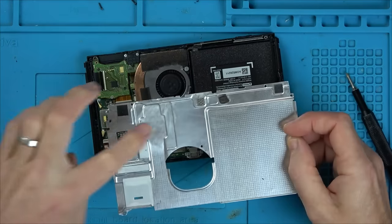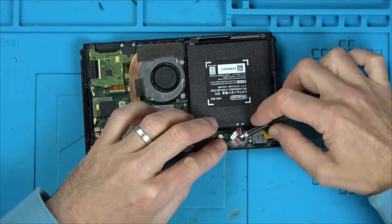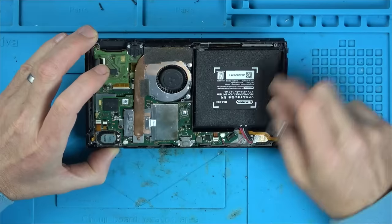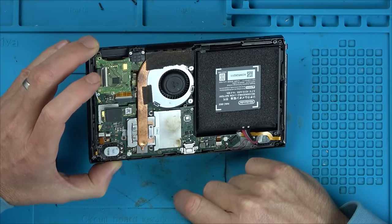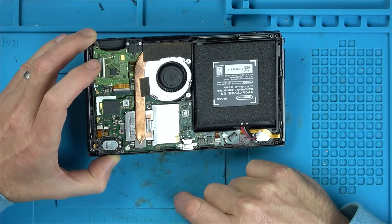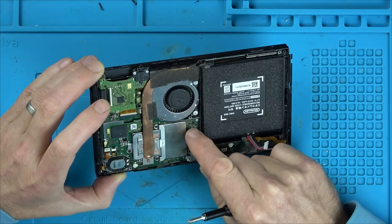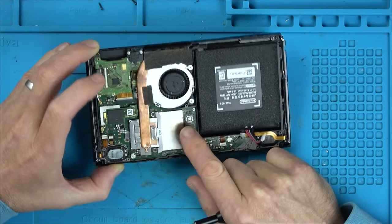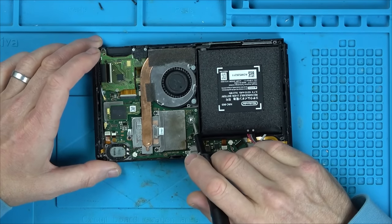Right, okay, the thermal paste has gone from here. Let's take out the battery. And this is where the M92 chip goes. Well, let's take the board out completely and let's see if we can get it back in. I think there's a big mound of solder in the middle there. We're gonna have to wick some of that away because otherwise the chip's not gonna connect around the edge. And maybe that was the problem when Tom tried to do it.